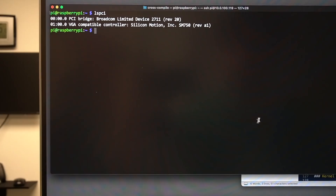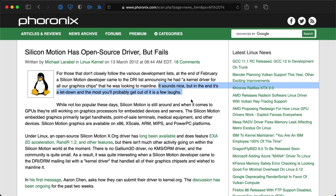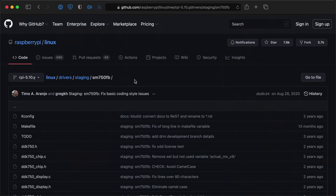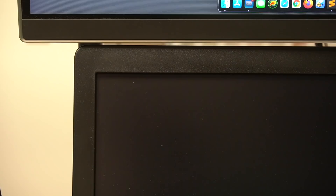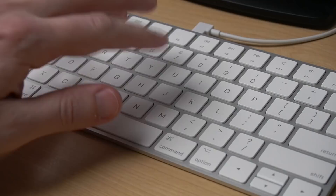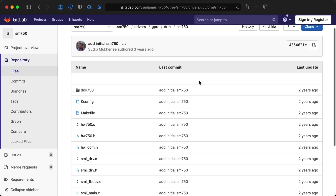I plugged it into the Pi and was happy to see the card was visible to the Pi and got bar space allocated at boot. But that's where this happy story turns south. After reading a Phoronix article about the sad state of the SM750 driver — and noting that the Silicon Motion driver is still inside the staging driver section of the Linux kernel after nearly a decade — I recompiled the kernel with the driver, copied the kernel to the Pi, rebooted, and got a frozen cursor. As with all the other cards, at a certain point during graphics card initialization, the entire system freezes completely: no input, no output, only cycling power gets things back up. I even tried another copy of the driver maintained outside the Linux source, and had no success there, even after trying it with multiple kernels.